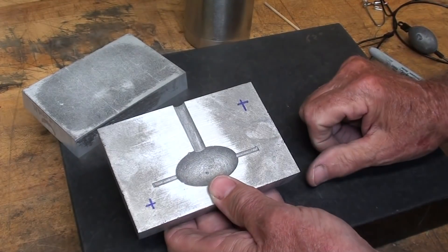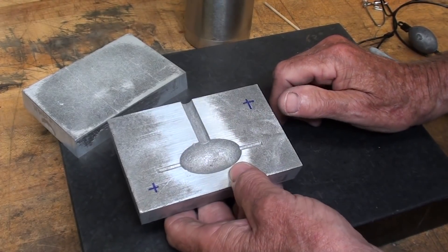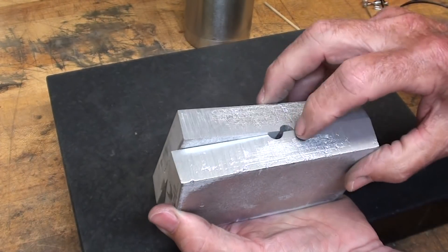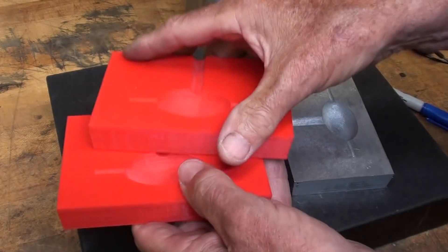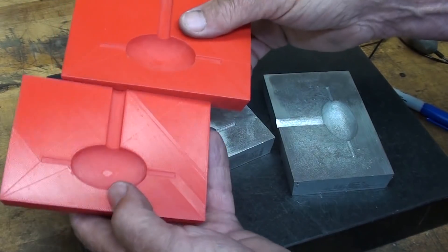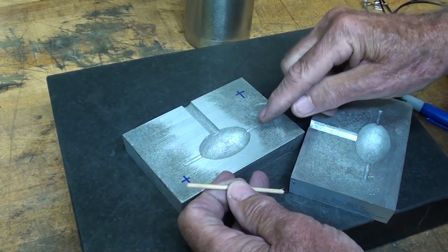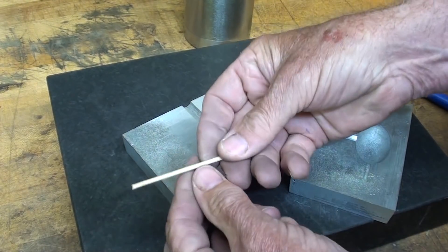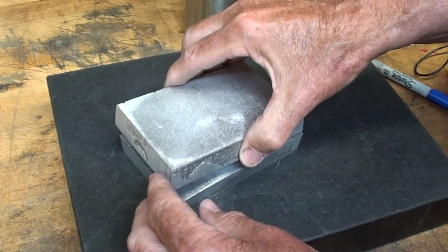What I want to do now is drill the two alignment pin holes. In the past I've always gone with quarter inch, but I'm going to go a little larger with five-sixteenths on this. Those are just the pins that will align the two halves and hold them together as they're poured, and I want to do that before I drill and enlarge this hole. I hope that my patterns were accurate enough — was this sprue truly in the center of the egg? I think it is. Remember, this is a core print, so we'll have a hole already formed in the lead egg. This is a piece of 1/8 inch wooden dowel, and we'll lay that in there as my alignment.